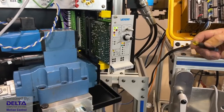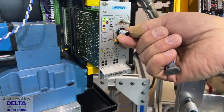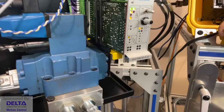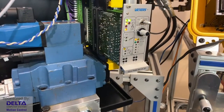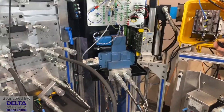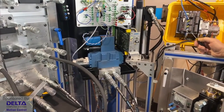That difference between the position I want versus the position I've got at any one moment, when we say, hey, cylinder, go to your extended position at 10 inches, if it's not there yet, in that moment we open up something called error. That's that term I spoke about at the beginning. And error just simply means there's now a difference between the position we want and the position we've got.